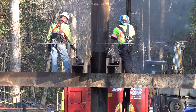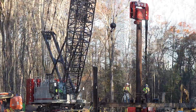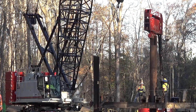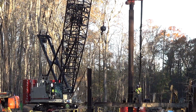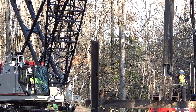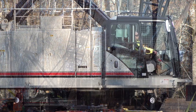We tore out an old bridge — it was an old wooden deck bridge with asphalt on top. Drove new piles, putting voided slabs. This job's tight, it's only about 75 feet wide. The piles were 80 feet long, 20 inch. Batter was 5 to 1. It's a tight area to work in, but it made it nice having an easy machine to run.